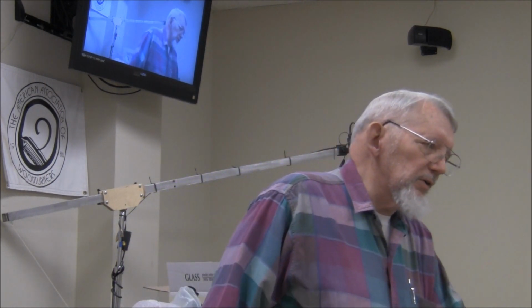I've read some about it, but I've never gotten really cranked about doing the heat treating. It's the old blacksmith, when he had the slack tub and he kept it off in the dark part of the shop so he could see what degree of red he had, whether it was a cloudy day or a sunny day. If you're heating metal outdoors, it makes a big difference. But heat treating, you really need control of your temperatures, and just looking at it and saying, that's cherry red, so that's 1350, and I'm going to stick it in the oil, and the oil is at 100 degrees, or should it be 200? I've never gotten into it, but in the anneal state, you can do all sorts of things.